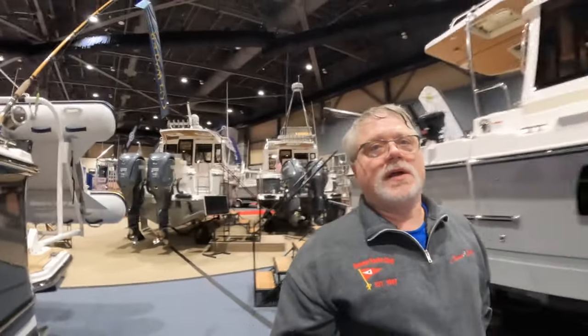The big difference in cruising speeds is that the RT-29 is going to cruise at 13 to 15 miles an hour, with wide open throttle around 20 mph. The RT-27 with the outboard will comfortably cruise at 25 to 30 mph, with wide open throttle around 40 mph with a three-blade stainless prop. The 27-foot outboard is really looking for flatter water to go fast — you wouldn't want to cruise at 30 mph in three-foot seas. The RT-29's added weight and defined keel make it a much better ride in bad seas, while the RT-27 is about finding good seas and getting to your destination quickly.